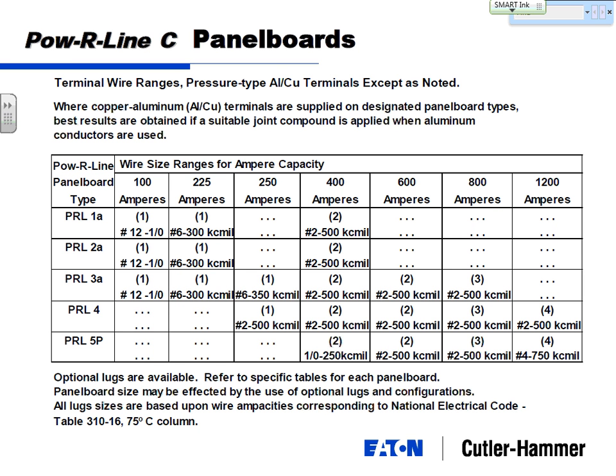When we make the main lugs and the sizes that we put these together, we follow pretty much the NEC wire bending guidelines for the cables that are suitable for the amperages. And on every manufacturer, when we put together a drawing for a panel board, it will show you the cable size, and you'll have usually a range, from 3-aught to 250 kcmil or something like that. And you have to keep your cables inside that range.